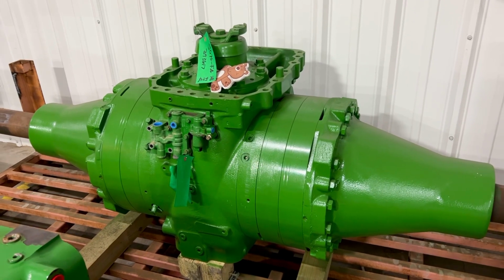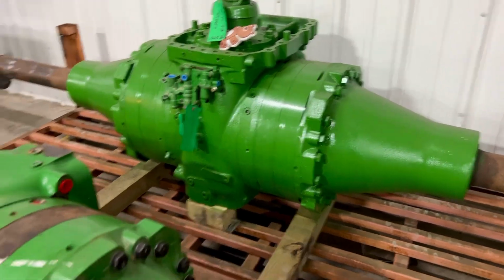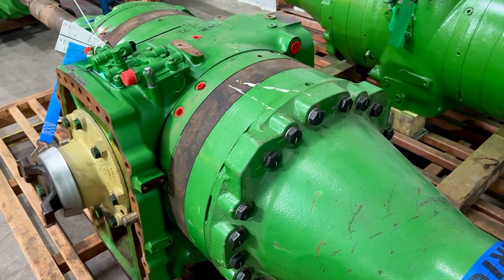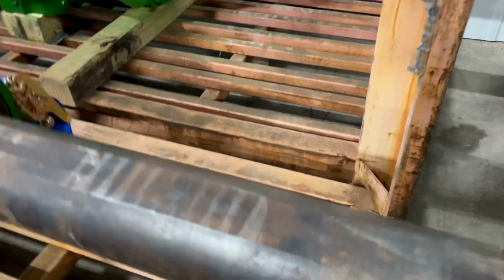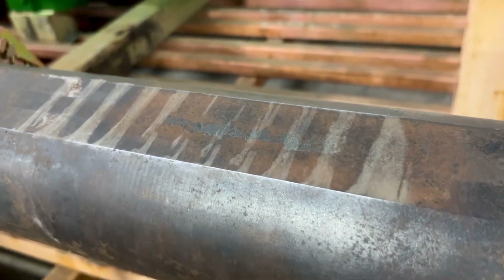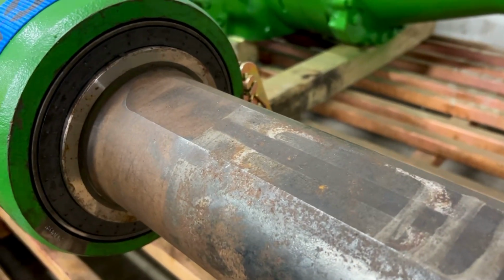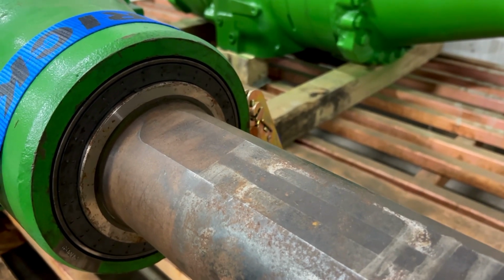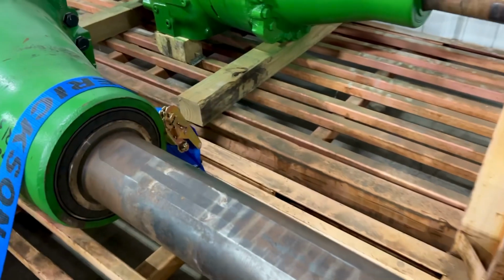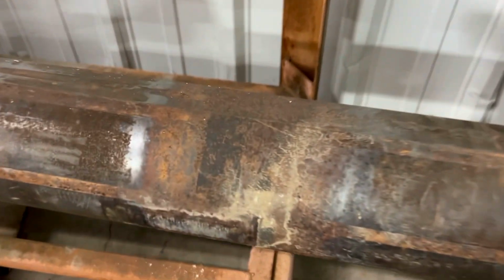John Deere 9R HydraCushion double reduction axles. So there's a round and a flat. Flat is for scraper, or we can upgrade you to the flat if you have a round axle, or if we don't have a round axle. So we build most of ours, if we rebuild them, we build them for scrapers because it's an easier conversion. Scraper guy doesn't want to go to ag.